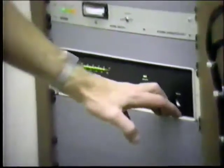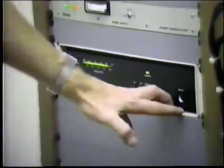This is a transmitter that transmits metering information and status information back to the studio so that this remote control can find out what's going on out here. It's called a TSL, transmitter to studio link, just the opposite of the STL, which is studio to transmitter link. And we have an FM tuner, which will eventually be hooked up in such a way that we can simulcast the FM on the AM in the event that the STL system should fail suddenly.